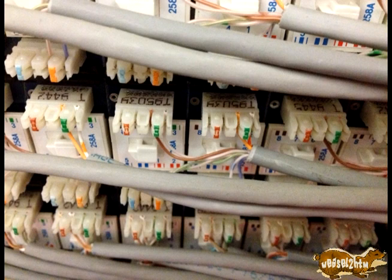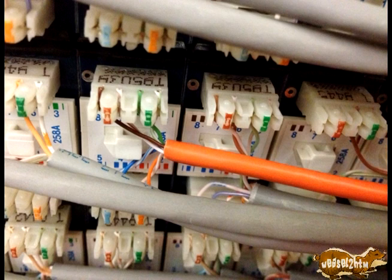People are having to unplug and replug their ethernet, and that's even if they can get it to work at all. So what I've been doing is in places where there are more jacks than what's needed, I'm simply cutting down the number of jacks at that location from 4 to 2 or from 2 to 1. However, in places where we need the jacks, we are running new cable and rewiring the old cable the way it should have been, with all four wiring pairs hooked up. This is fixing our problems with computers with onboard gigabit networking cards and our core switches running 10/100/1000.